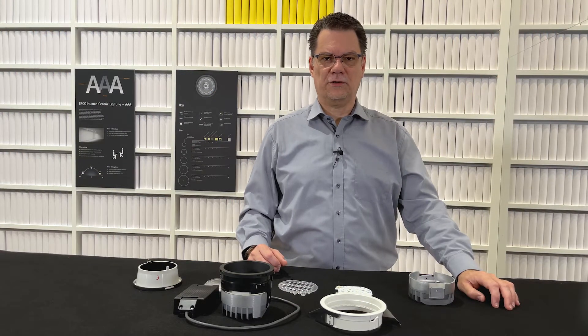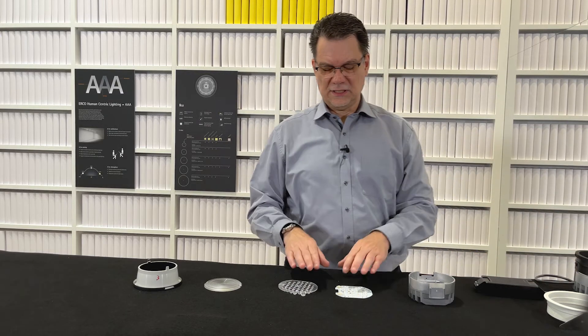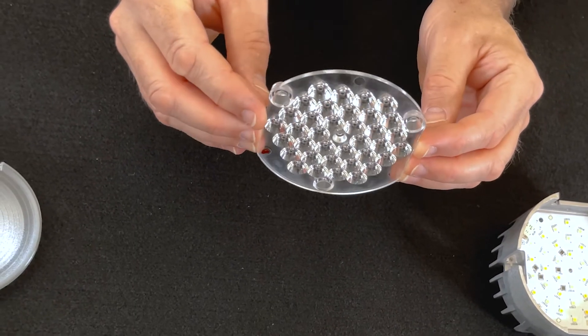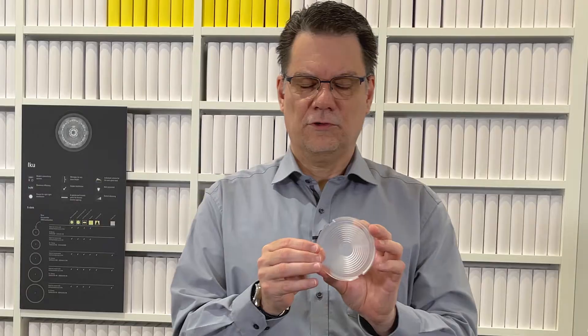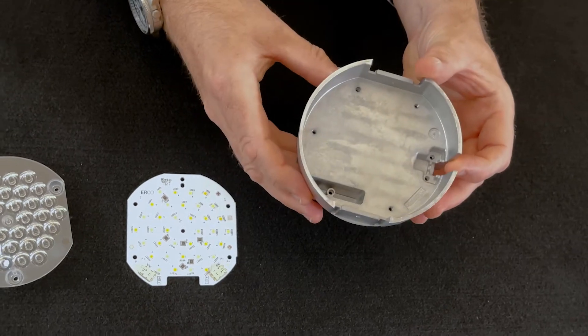What are the innovations of IQ? Let's start with the downlight. Of course, we're using this standard ring, as you already know. And this is the downlight as I have shown it to you. Here now the insides: a brand new LED board with a special distribution and special placement of the LEDs. Linked to the new collimator plate with new collimator lenses on top of it. Then we have the lens system for different lighting distributions, which we can now snap into the reflector to really get the perfect closed front end of the luminaire. The secret behind the scene is the cast aluminum cooling device, which allows the perfect connection to the board to transport the temperature away and maintaining a long life.